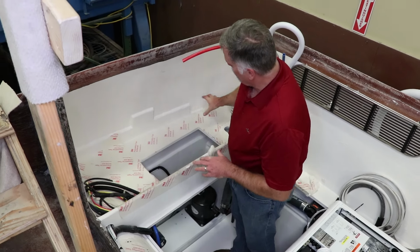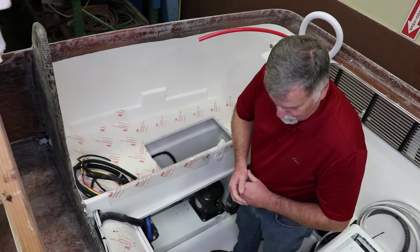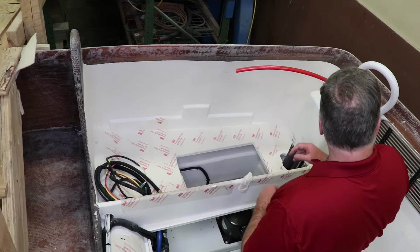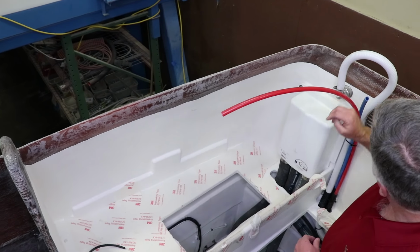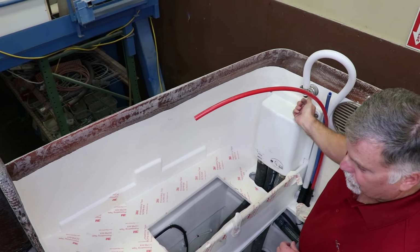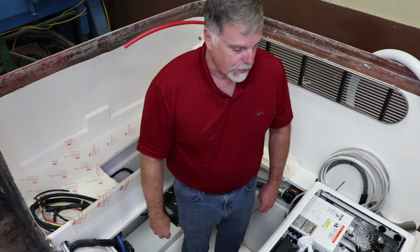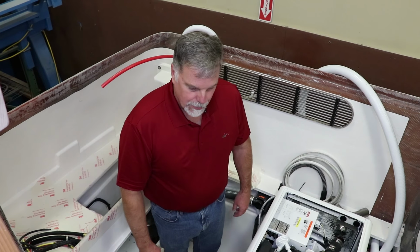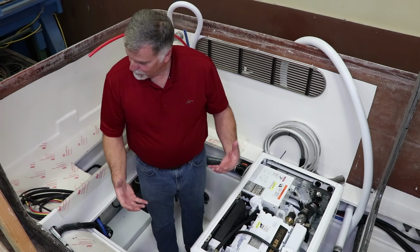This becomes a great big storage area for the customer. Another big giant bulkhead and beam. You can see up loops for pumps and so forth, and all stainless steel fittings throughout. And again, all these bulkheads are all overwrapped with glass mat and roving through the whole thing. So that's basically our open hull walkthrough right here.